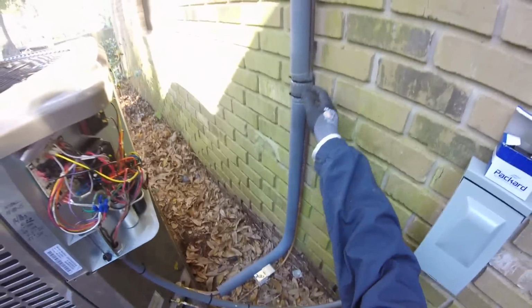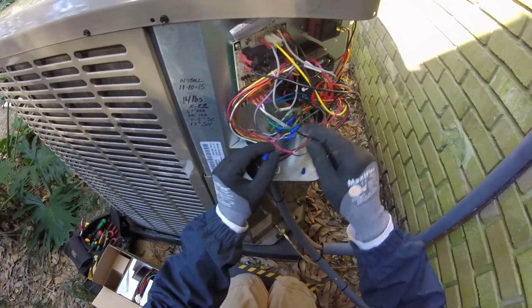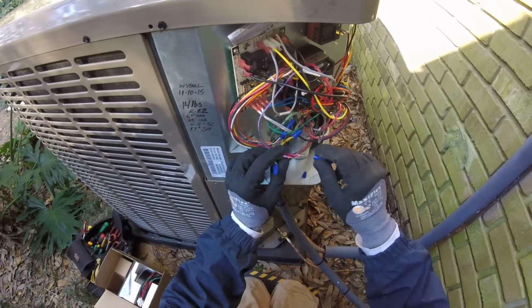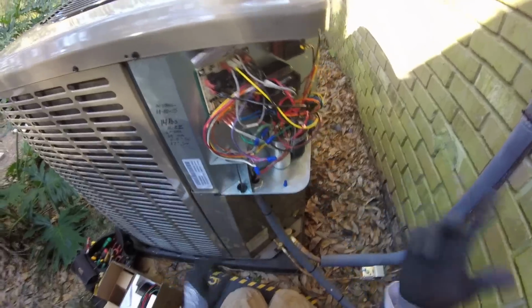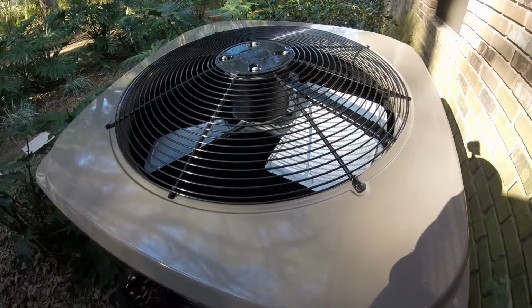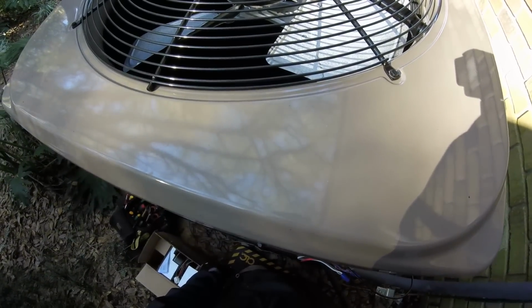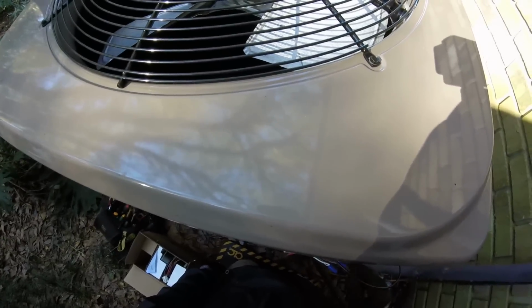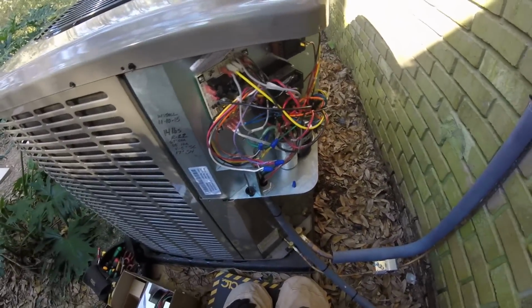she's out on overload. As you can see, guys, I've got a liquid line solenoid on this unit, simply because it's got a half inch liquid line, and this is for off cycle migration control. So what we're gonna do, we're gonna go ahead and power up that solenoid. That way we're not going to start building up pressure or anything. All right, let's try this again. Nothing.